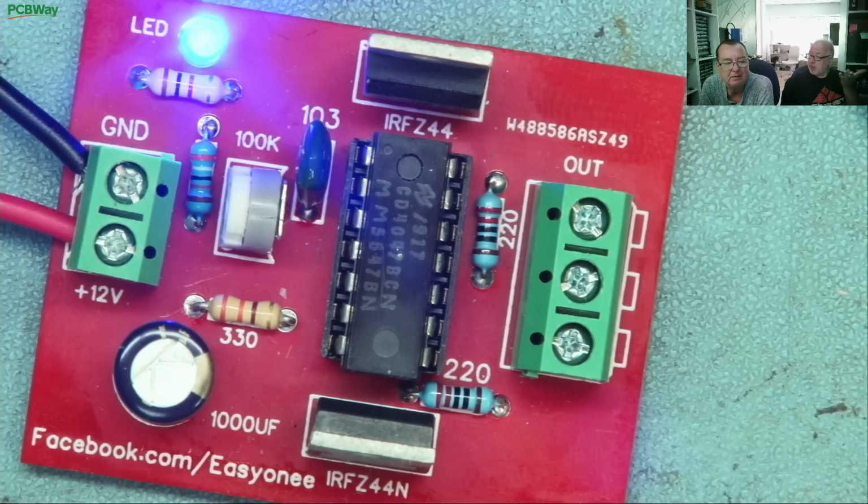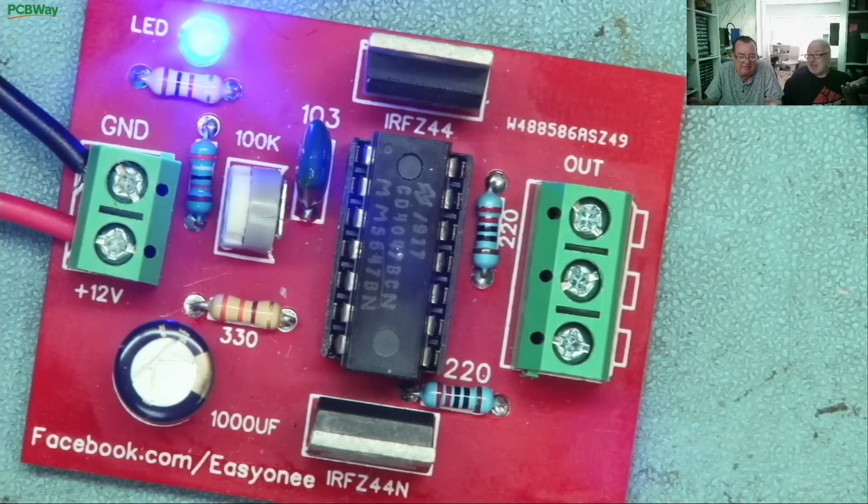We had the same problem. Remember the ATtiny85 I bought from AliExpress? Same there. And these are chips that are below $1, so it makes sense for somebody to fake these chips. We never found out what they really were. They were simply rebranded something, and we were lucky that they didn't blow up anything. They just didn't work. Okay, so guys, that's that done.